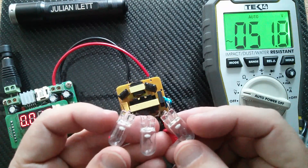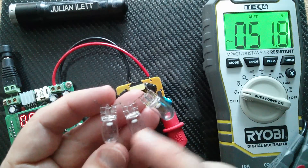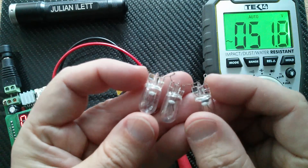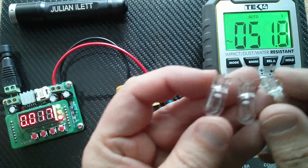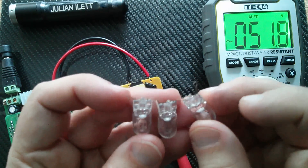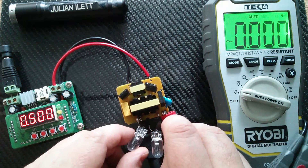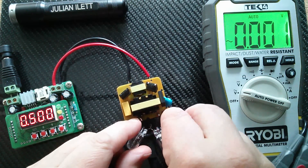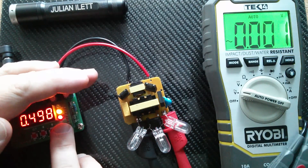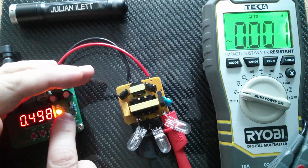I've rigged up this set of three bulbs — these are 12 volt bulbs, so nominally this is 36 volts. I've just put little loops in the wires on the ends here and twisted the wires together because these wires will not solder. So I want to turn this thing off and then attach the ends of this bulb array to the outside connections on the AC output, switch on and see what happens. And nothing happens — we've got no volts coming out and we've gone into constant current at 500 milliamps, which is what I set my limit to. So I'm going to have to raise that current limit.